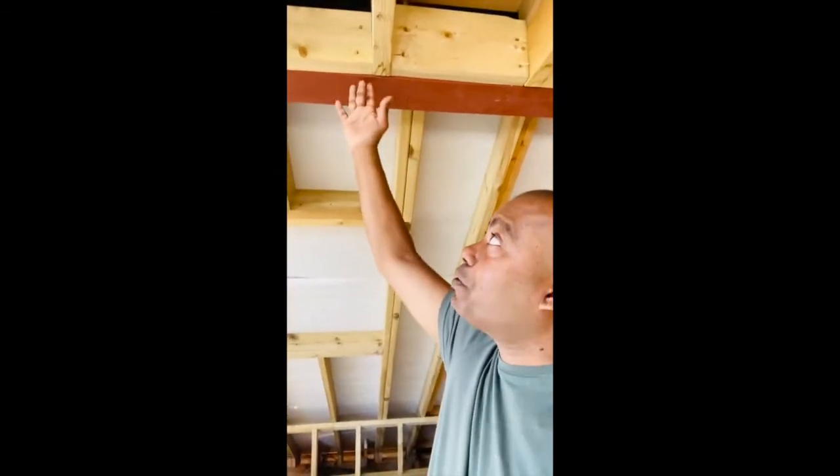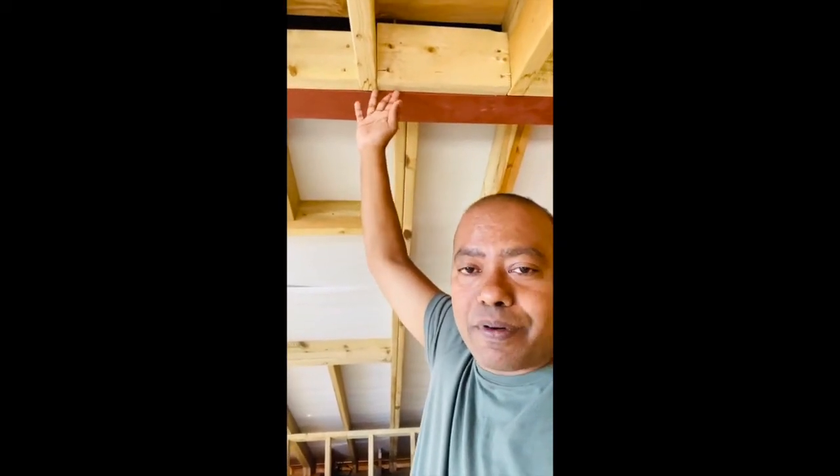On my project, my house, I had five steel beams, 5.5 metre span, six by six. I spent about £1,400 — it's very cheap: four on the floor, one on the ridge. Prior to this ridge, it was a simple rafter butt joint supported by the purlins. The whole tiles weigh around 700 kilos — that's more than half a ton — and that was supported by the purlins and the rafter butt joints.